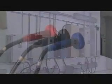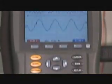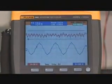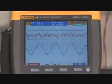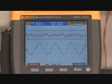All of the testing we have done so far was done on the VFD without the lineator connected. We are now going to shut down the drive and connect the lineator and do the test again. We now have the VFD running at full load with the lineator connected. Again, the bottom trace on the Fluke Scope shows the input current to the lineator and VFD. As you can see, the current waveform has changed dramatically.